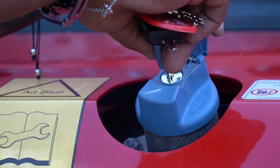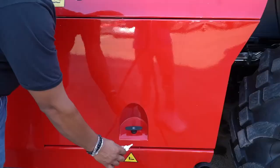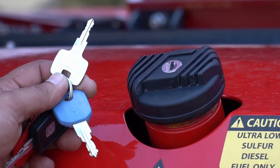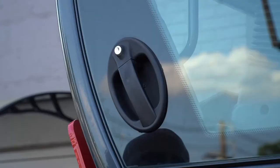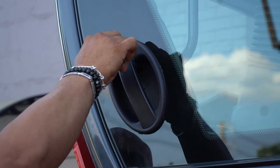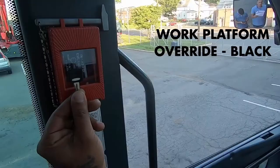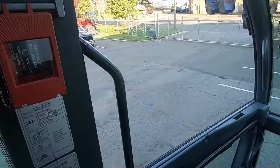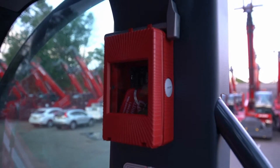The Magni comes with several keys. All keys are the same for all Magni models, except for the fuel cap and DEF Add Blue cap, which are unique to each machine. There is one key for all service compartments including the engine, chassis, and turret compartments. Next we have the fuel cap key, the DEF or Add Blue cap key, the cabin key which locks and unlocks the cabin door, and the ignition key. There are also two override keys — one for the work platform override and one which is the safety bypass key. These two keys should always be kept in the emergency key box located in the cab.